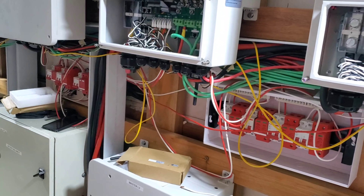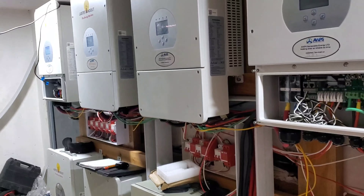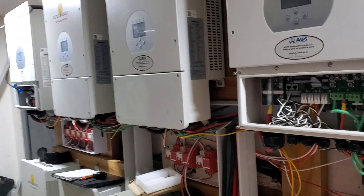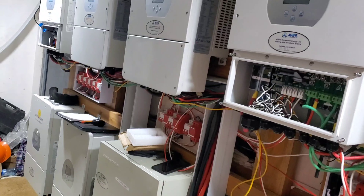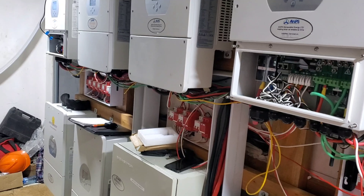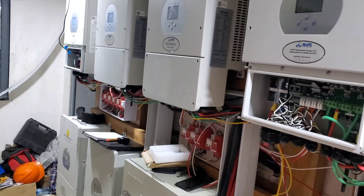While it's fine that you offer GPRS, from my experience and from most of the solutions we've done, you should give us an option of either GPRS or Wi-Fi. Yesterday we went and purchased SIM cards for the six that had GPRS. We purchased three from MTN and three from Airtel. The Airtel SIMs didn't work; the MTN SIMs worked. Then they tried to push the firmware updates through, and guess what — the firmware updates did not take.